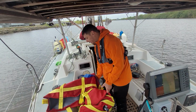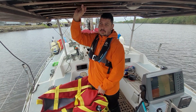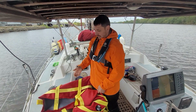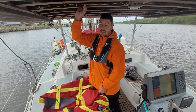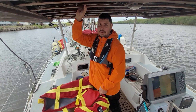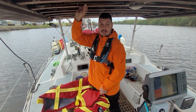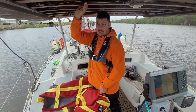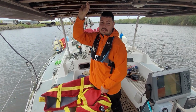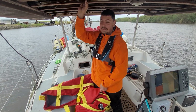Mathematically, we're on a Beneteau, a 1985 Beneteau Idylle. We're 38 feet long, we displace about 15,500 pounds loaded, and this drum setup will tilt a boat of up to 20,000 pound displacement. So anybody that may want to duplicate it, if this works, now has the rough dimensions and weight and displacements of what we're dealing with. Our keel, I believe, is 5,200 pounds, and our mast, I think I said it already, is 51 feet tall. Our beam is 12.5 feet wide.